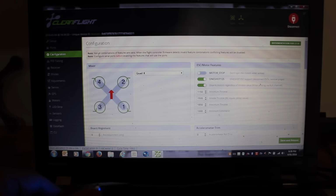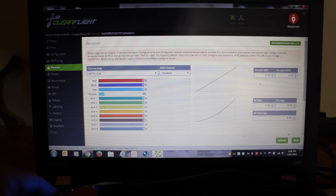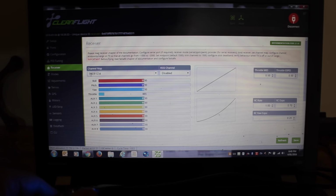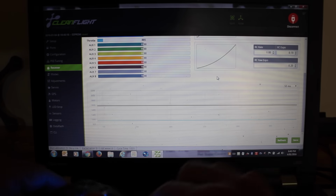Alright, so all those settings are saved, and the other thing that's really important that some people can get stuck on when they start is to click over to your Receiver tab just here, and if you're like me and you fly a Taranis, make sure you click on this one down here, the JR Spektrum, because that's how it maps our channels. Just there, TAER 1, 2, 3, 4, that's how we actually fly if you use a D4R-II and a Taranis. Alright, I'm going to click Save. And that's it, we're all good.